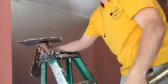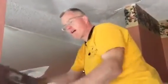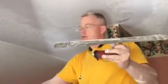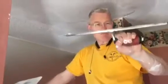So now, why do we have a thick trowel? A long 20-inch. My helper didn't clean it off, it's all right. The reason for this is, the wider the better, remember? The wider your trowel, the better the chance you have to fill in gaps. If it's short, you'll be plastering in the gap rather than over it, right? You get the idea. The longer and the flatter it is, your ceiling and your wall are going to mimic this beautiful flat surface.